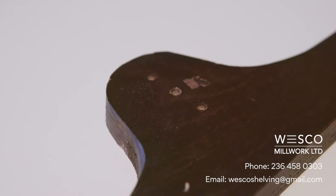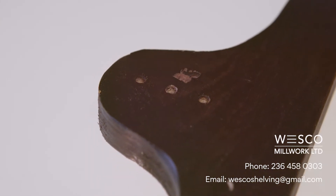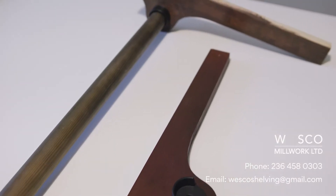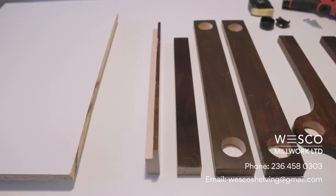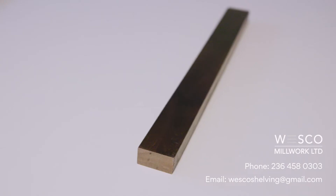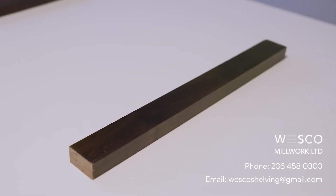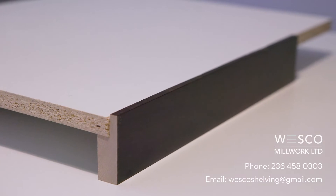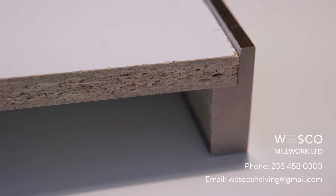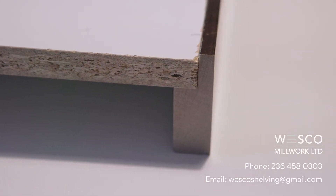Also notice the 3/16 inch hole in the center and the two indentations on either side to accommodate the metal closet pole holders. Note the end brackets are engineered for standard closet measurements with three-quarter inch plywood. The rear support is solid hardwood — it only needs to be cut to length. The front support is also hardwood. Notice the groove on the back side of the board; this groove serves as a support for the shelf board. Note also how the edge of the shelf is concealed.